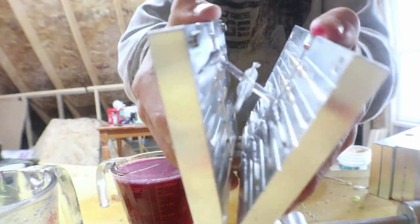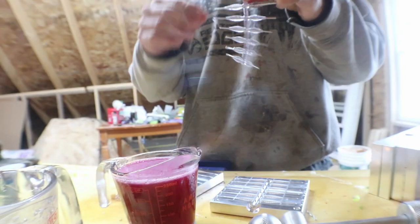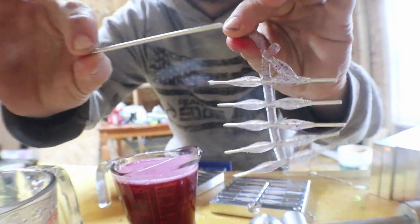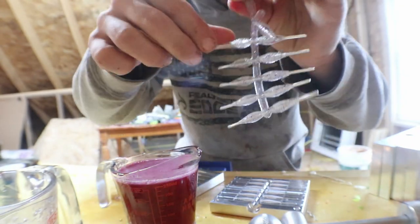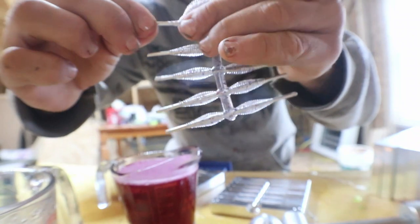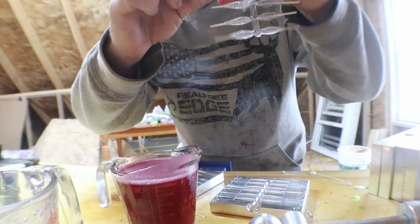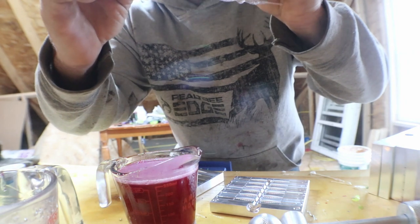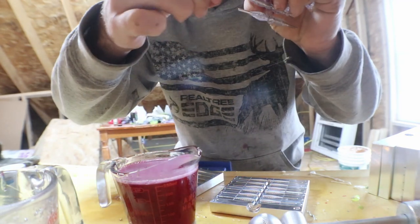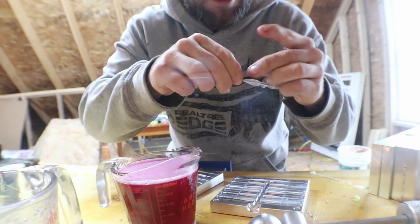It's chilled down to where I can pull the top of the sprue off and crack this bad boy open. You can see they come out attached to their posts. What we're gonna do is just make sure the colorant isn't stuck on the hand — if anywhere is real bad you just grab one end and pull it through, then your separation bar comes out and you're left with just the hollow shell of the bait without the core shot in there. I'll go ahead and pull these off and then get probably six or eight more batches made up real quick, and then we'll start doing the core shots. I'll just do a time-lapse from here till I start the core shot.